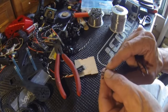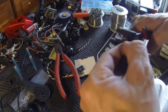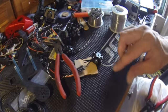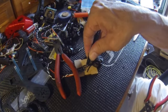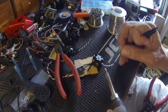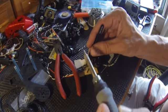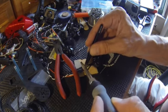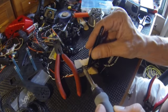Alright, I checked the lengths on these. Sometimes it's a little long — you want to trim a little back, like that one's just a hair long. This one could use a little bit off of it. Alright, so we're looking good there. Now we're going to do one in parallel and one cross for motor rotation. And again, this is a quick setup right here. You want to clean your tip, put a little on there — see how I got a little on there on that inside edge. One down, two down — these are nice — three down, see that.